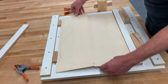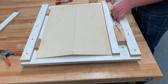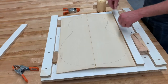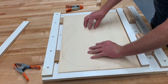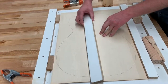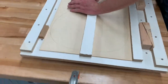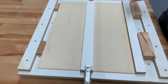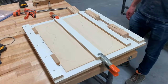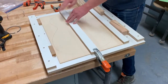You'll want it lifted up a little bit. You can adjust your clamp blocks — the little wedges — if you need to. When you put some good pressure down, it should snap down with nice tight pressure. Grab the little block that has wax on one side, put it right on top, and take some little spring clamps to clamp that in place so it stays nice and tight. Let this dry for at least 30 minutes, then go ahead and take everything off and get your piece out.